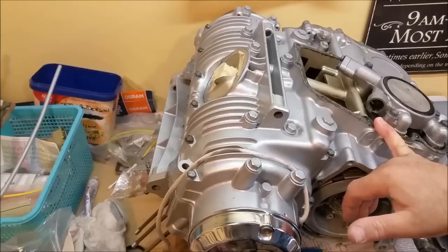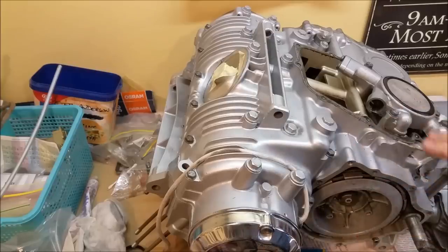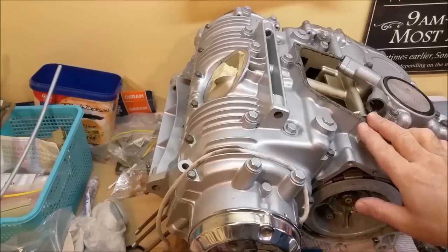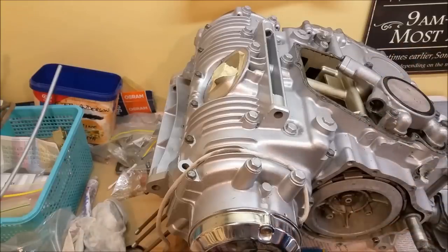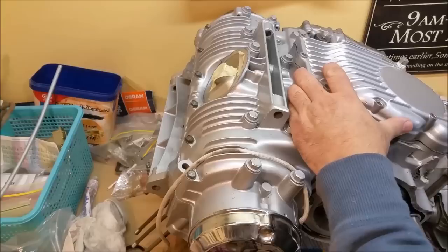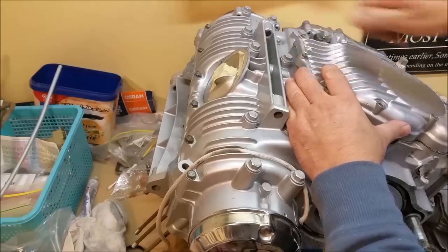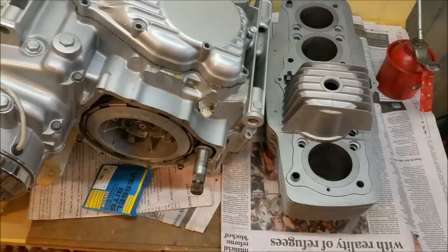I'm going to have a good look at the secondhand one, but I ended up making one anyway out of a scrap of round rod. You have to use bright steel round rod — you can't use black steel. Black steel is great for railway tracks but bright steel is much better for turning; you can cut a fine thread quite easily. I've got it at work and I'm halfway through — I've only spent about 60-70 minutes machining it up. I'm thinking about using that and doing away with the aluminium one altogether. If I can make one for nothing, I'm going to do that.